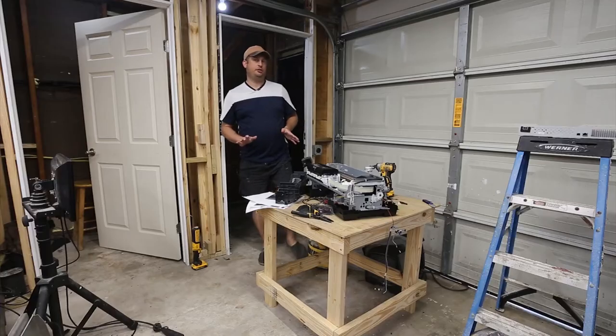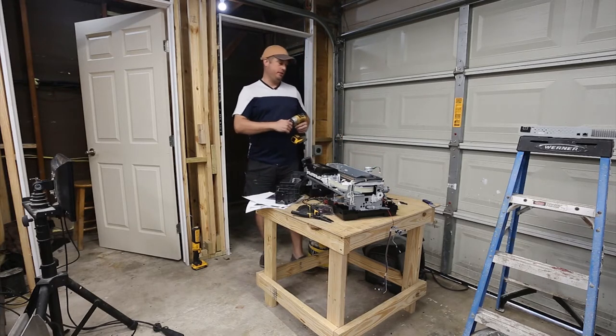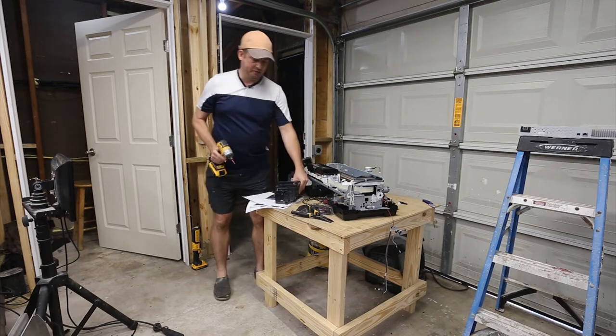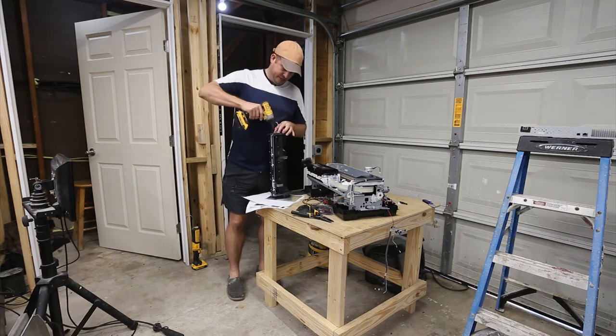So I'm going to continue my build of an Epson P600 into an open direct-to-garment printer, and I'm at that point where the documentation kind of runs out. One of the things you need to do is find this automatic sheet feeder, and there is a circuit board on the end of it that needs to be removed, and this circuit board gets repurposed.